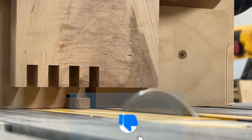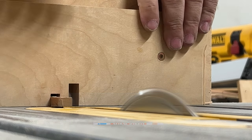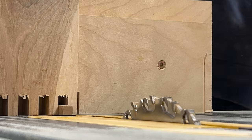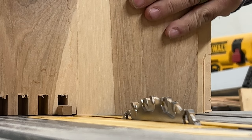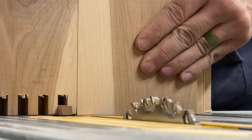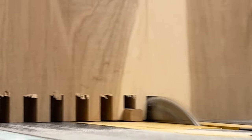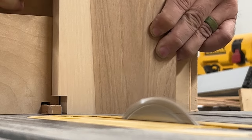As always, if you like my content please hit subscribe, hit like, and get those notifications — leave me comments, I love to interact. You get nice even slots here. To make the next side match up perfectly, use a full notch and run your next board up against that — it'll cut a perfect notch out of the front of that board so they match up nicely. I have a little tear-out so I need a new spoil board, but I'll clean that up with the sander before putting it all together.